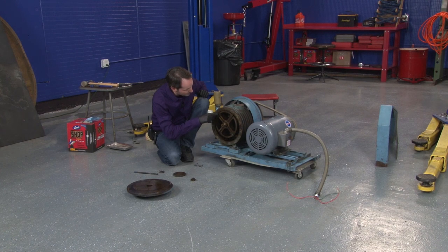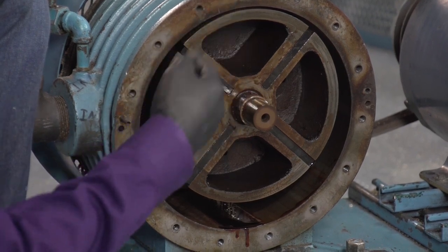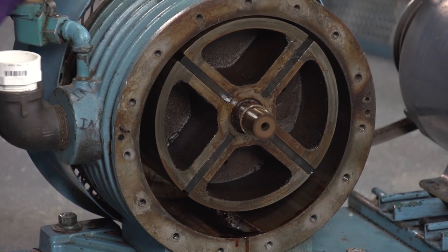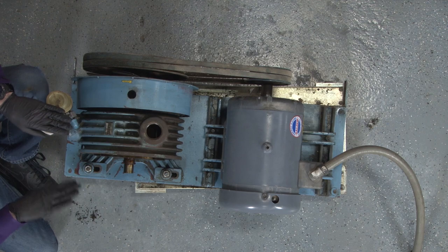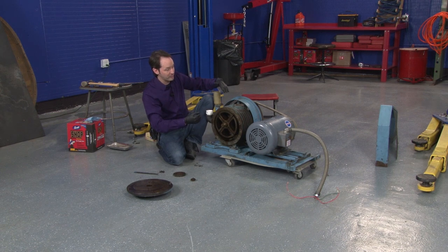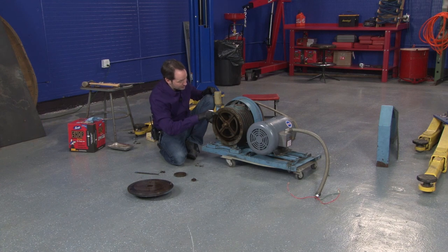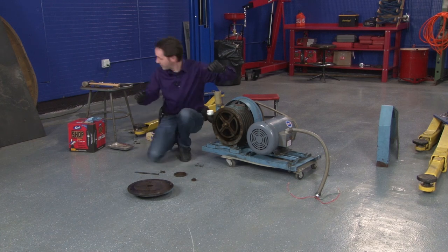But if we take these out, and they're relatively smooth along the top, like they're in good shape, and they've got a nice bevel on each edge, and there isn't, because the holes are halfway in. So if we take one of these out, and there's a big worn spot in the middle where it goes past the holes, because that might be acting kind of like a plane, and just shaving it off a little bit, then we know that these are worn out if there's a low spot at this top seal. But if these are straight across, then it's okay, and we just have to clean it, and this pump could work again, and that'd be really cool.